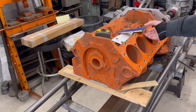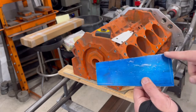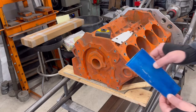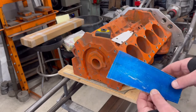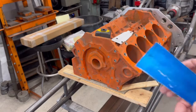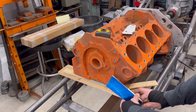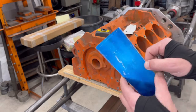Jimmy's in the other room cutting the other motor mount. If you look here, he scribed it but actually cut it larger on both sides. What we need to do next is find exactly where we want these based upon where the bolt holes are going to be so we can get those drilled. Once we get those drilled, we're going to chuck these up in the mill and straight-cut them — a bandsaw is just to get a rough cut; the mill will actually make it straight, true, and clean-looking. So the next step is we're going to transfer where the holes need to be based upon where we'll have our chassis tab, get our holes where they need to be, get those drilled, and then make our final cuts on this in the mill.